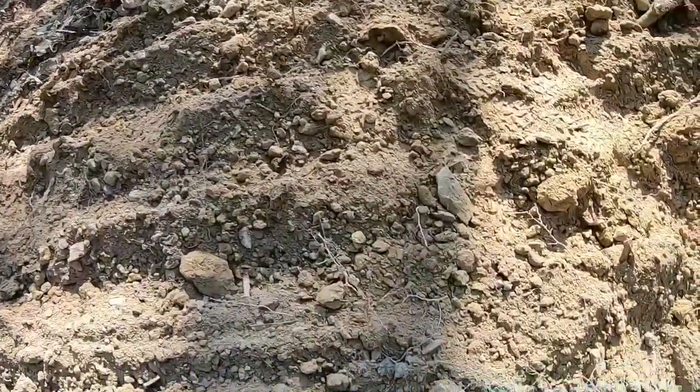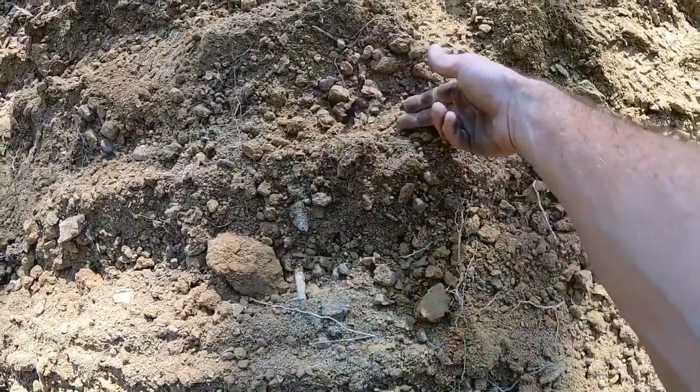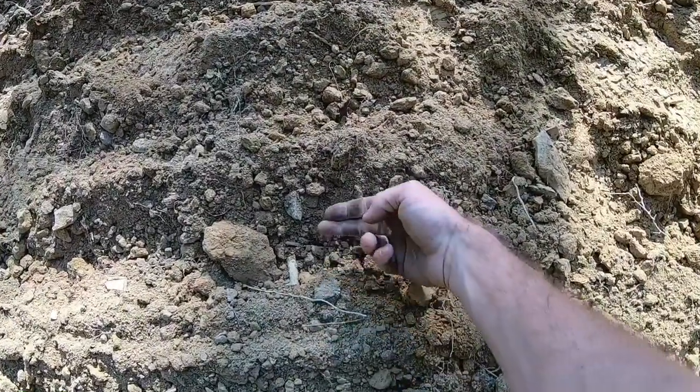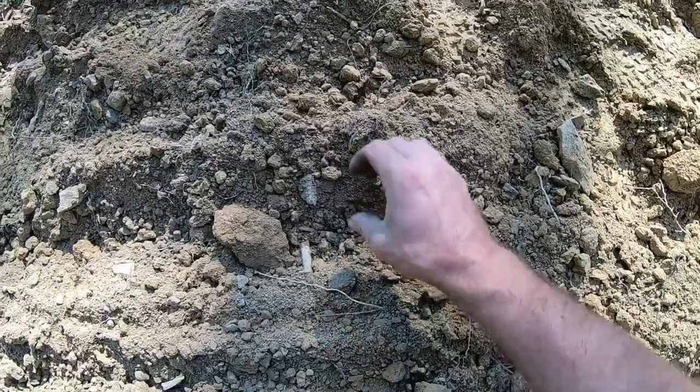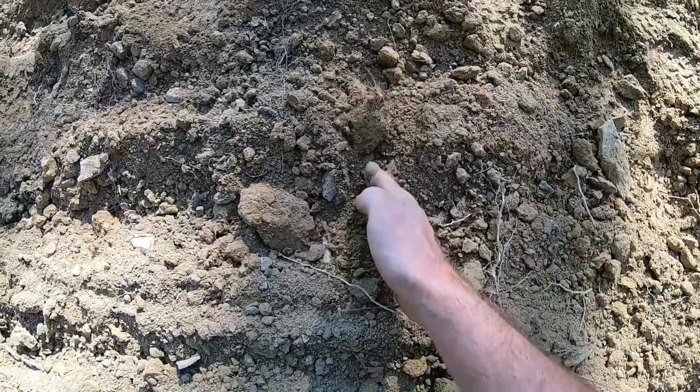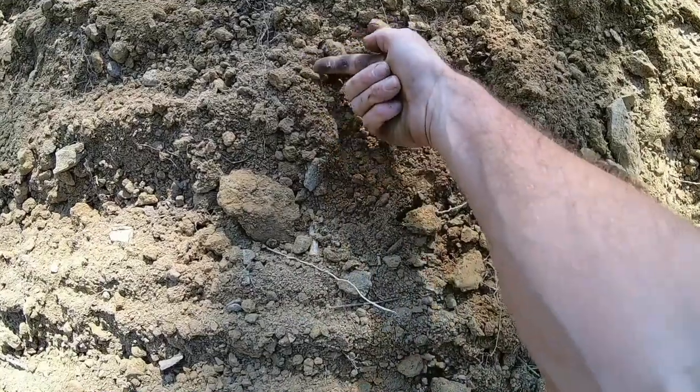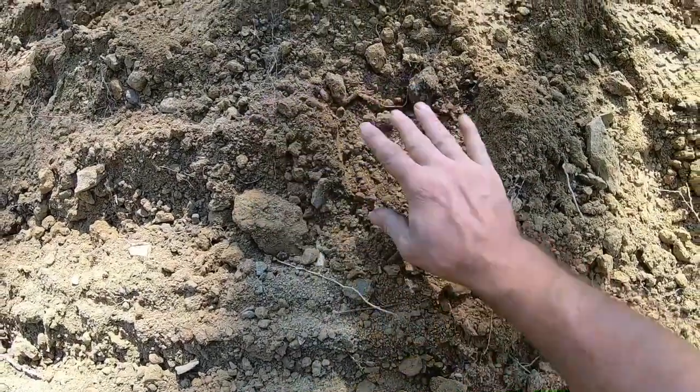Presby wants you to leave the teeth marks so that any gray water can't just go screaming across here. This gives a place for the gray water to sit and take time to percolate. It's also more surface area if you take a cross section, super fancy cross section there, more surface area here than if it were flat. So they like that for more absorption.